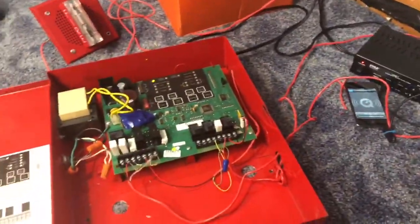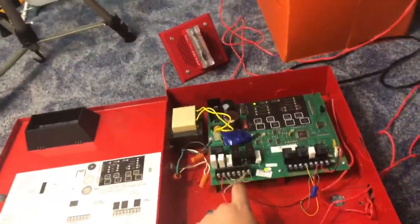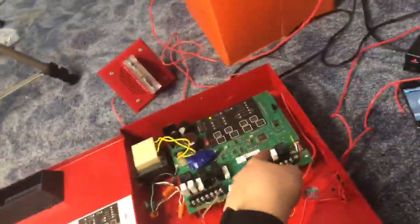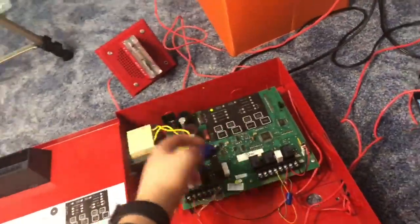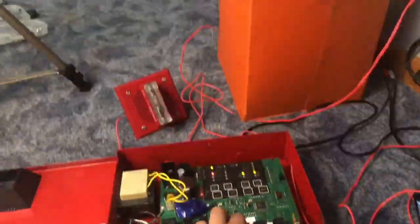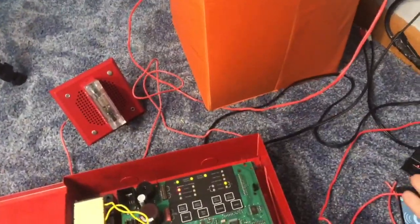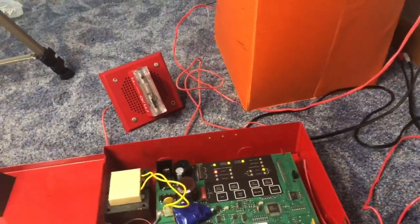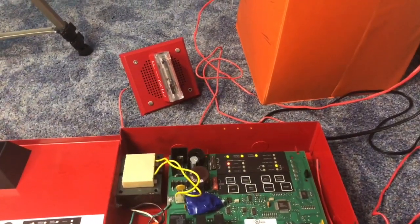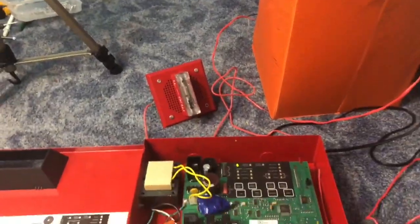Here's our panel. The NAC just goes to the NAC of the strobe. I'm going to have to silence the strobe because acknowledge doesn't turn off the loud PA. Ready? Three, two, one. I could have said it a little louder. 'Do not use the elevator. Walk to the nearest stairway. Attention. Attention. Attention.' Now we'll reset — and our message has stopped.